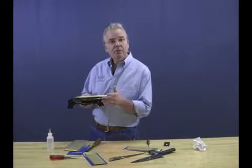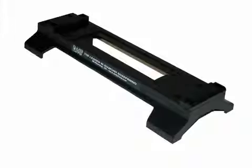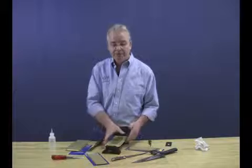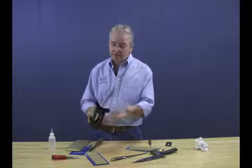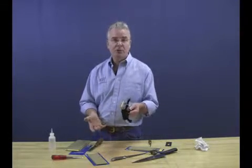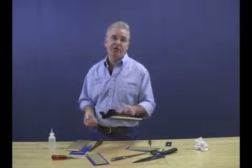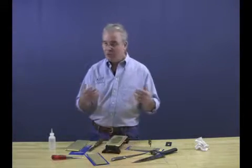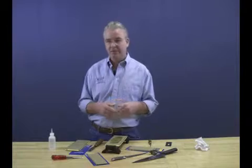The last member of the family is the Duo Base — a plastic base that works with either the 8-inch or the 10-inch stone. It gives you a good two inches of knuckle clearance on the table, has non-skid rubber feet on the back, and also has a handle you can use to move the diamond whetstone relative to the surface you're sharpening or honing.